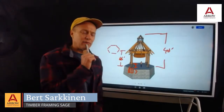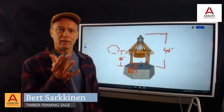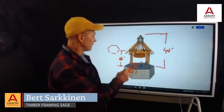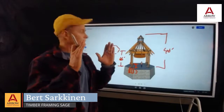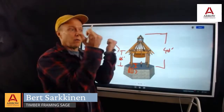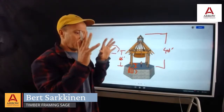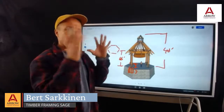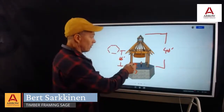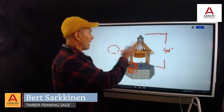And I got inspiration from post-tensioning or pre-tensioning. So what we did to hedge my bets that it wouldn't just lean sharply one way or the other is we tip each one of these in just a little bit, so that once those posts were installed, we had to push the posts out a couple inches, just to pre-tension that whole structure. With everything pushed, fighting each other, it just kind of pre-tensioned itself and was right on. And as long as it can't break the wood or that metal base, this will not fall over.